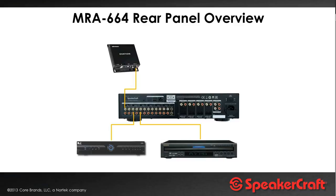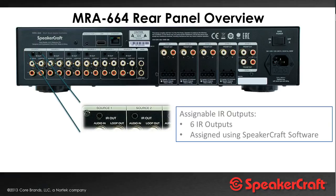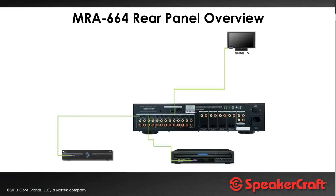In a typical scenario, I have three audio devices connected to inputs one, two and three. The infrared outputs per zone are independently assignable, so you don't have to use the IR outputs on source one for the device connected to source one. For example, if it's an iPod dock you might not have IR control for that source — you may well want to control a TV in the lounge. So here I'm showing sources one and two with their IR, but source five's IR output is used to control a TV. Very flexible.